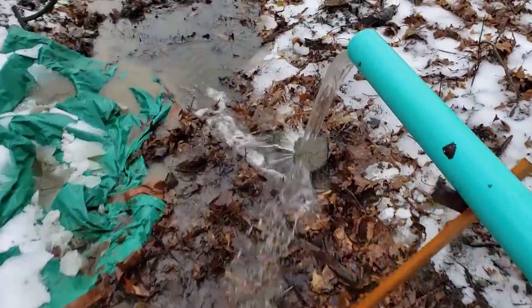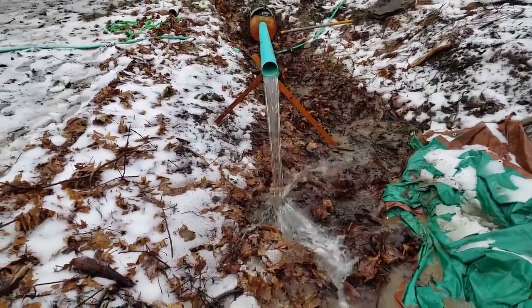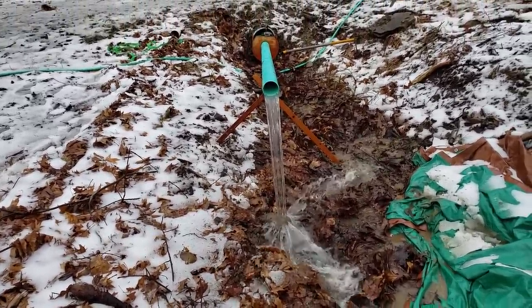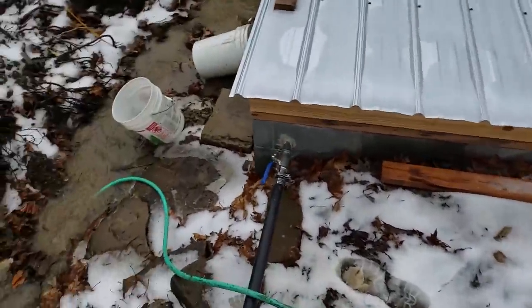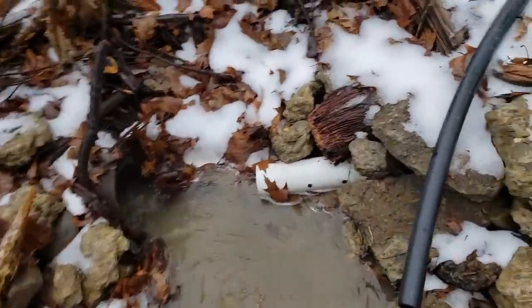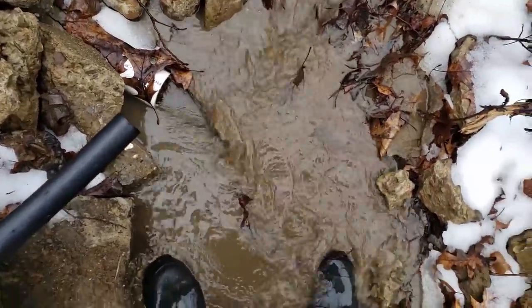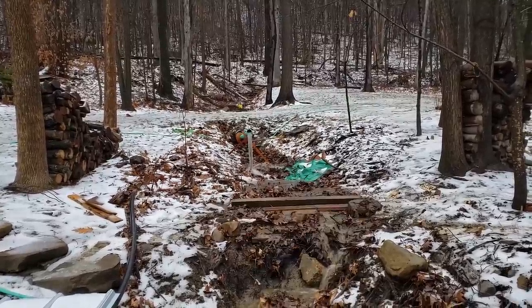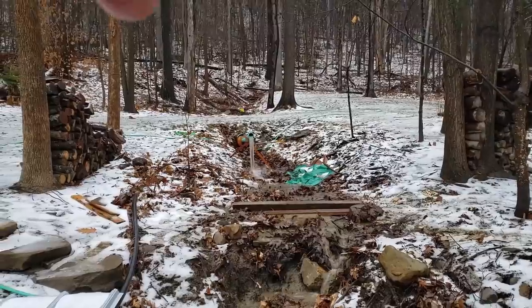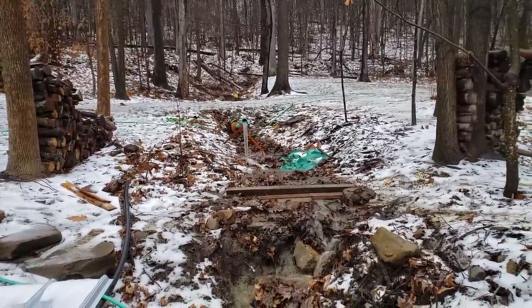I have the water coming down here out of the pipe, and that alone is almost high enough to put a water wheel under — and that's a few feet after the pipe. If I put the draft tube right here at the outlet from my turbine, I'm holding my camera at eye height right now, so that'll be about five and a half feet. We can see the pipes clearly coming over my head, so we're gonna have six or more feet of head to test with. That should be ideal.